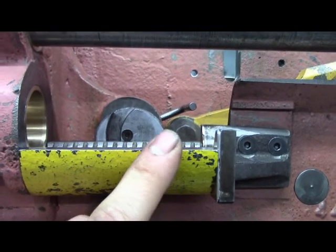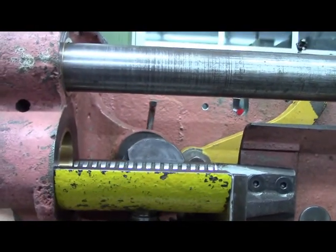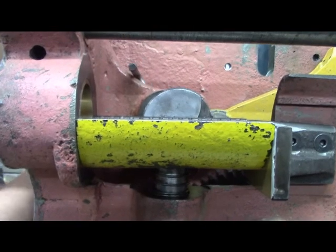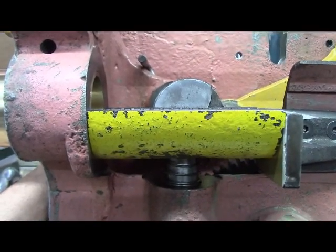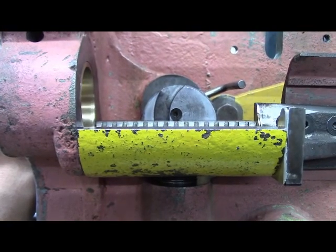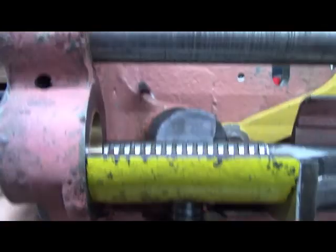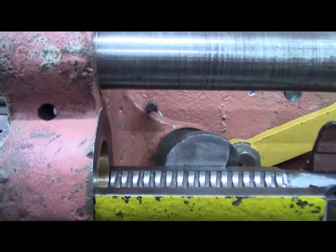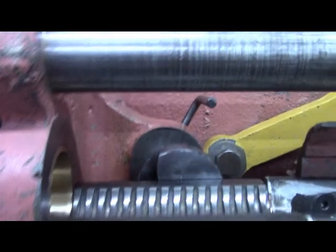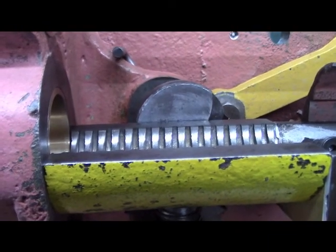And you can see, to prevent the cam from going too far, that's what that deal is. So there's retracted, there is engaged, and to prevent the cam from going too far, if I go further that way, the cam roller will drop out of the cam slot. But if I go this way, I'm in the sweet spot of the cam there, where the cam is almost horizontal. So as you can kind of see, there's the smiley face. The cam is right in the mid position, like right there. And it over travels just a skosh, but it's like top dead center.